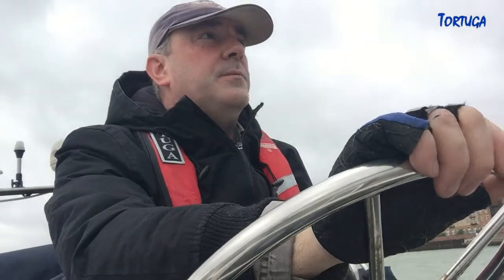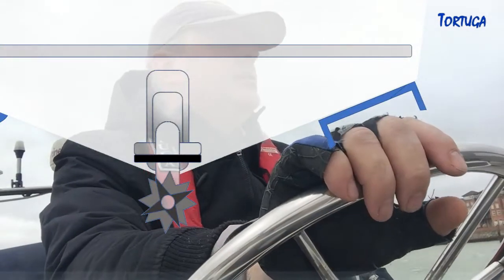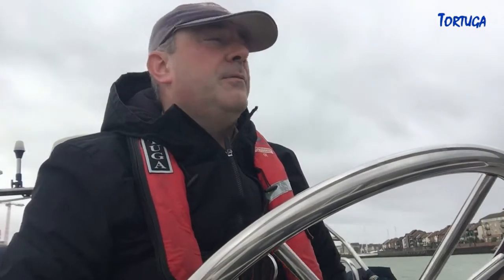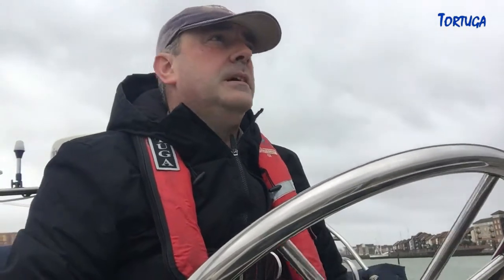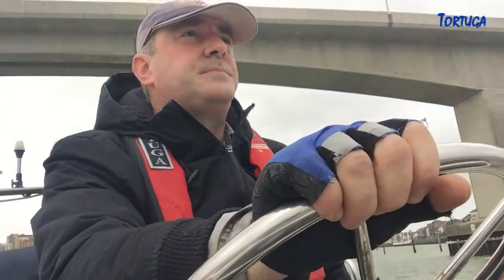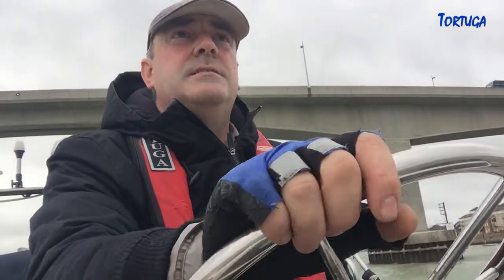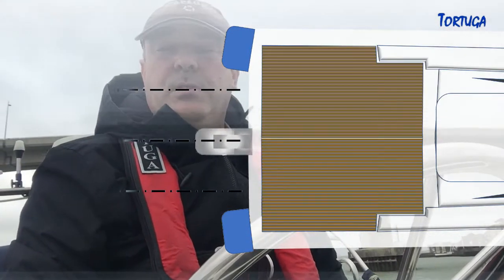The problem with these particular trim tabs is that if you look at them in cross-section, they are basically an inverted U-shape. What that means is you've got two small rudders pushing down below the boat. The U-shape — the rudder shape — is not parallel to the centreline of the boat. So what that's actually doing is the left-hand trim tab is trying to push the boat to the left, and the right-hand trim tab is trying to push the boat to the right.